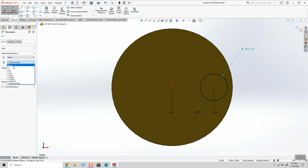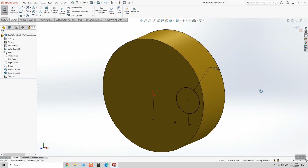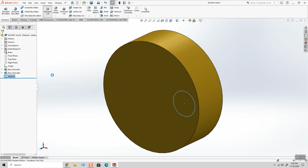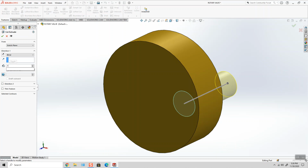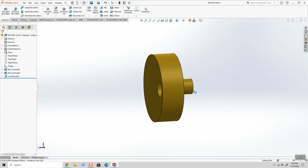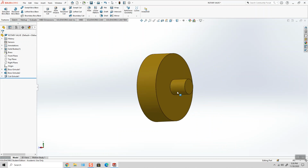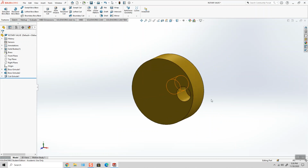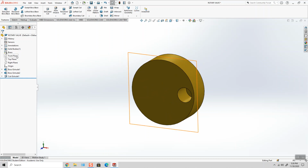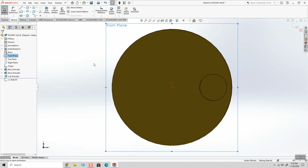So I'll switch that to three decimal places so that we know it's 126, not 125 for this hole. And it's cut straight into the part at a depth of 150 thousandths. So we've got the post that's 125 thousandths on the back. We have the hole that's eccentric. It's off center. And now we can attempt this cutout. So again, on the front plane, all four sketches have been done on the same plane, which is pretty cool.